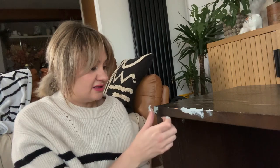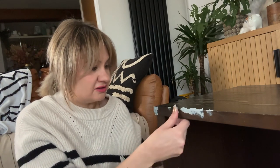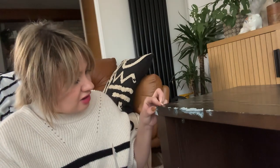I'm actually using my fingernail to get it out — with small fillers it's better to use your hands at first because it helps it stick a little bit better, maybe it's the warmth of your hands. Now I'm going to use the card and just ever so gently scrape down the edge to flatten it off slightly, and then do the same to get the excess off. Then I'll do the same along the top because you don't want it there.